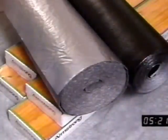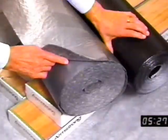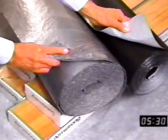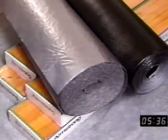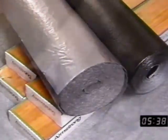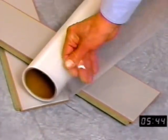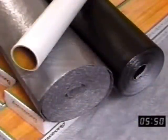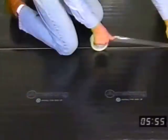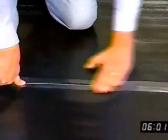You'll also need underlayment to put under your new laminate floor. Armstrong's QuietComfort Premium Underlayment and 2-in-1 Advanced Underlayment provide a cushion, help absorb sound, provide a thermal barrier, and compensate for slight subfloor imperfections over any subfloor. Armstrong's Moisture Barrier Sheeting should be used instead of QuietComfort or 2-in-1 when installing laminate that already has an attached foam underlayment. All three Armstrong underlayments provide a moisture barrier when installing over concrete subfloors. Over concrete, seal against migrating moisture by taping the seams of the underlayment with polyethylene tape.